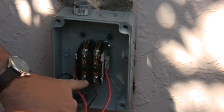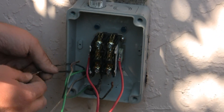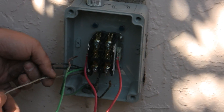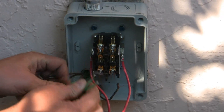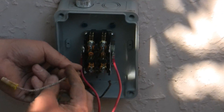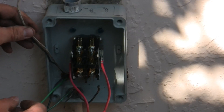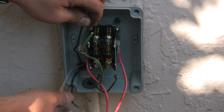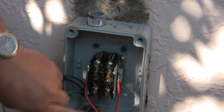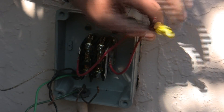Top is the in, bottom is the out. Pump was going off at 220. They had two legs of 110 and a neutral, which I believe was what was disconnected or not connected. And the ground — as we connect to the pump ground, we have our neutral circuit, and we'll take the neutral and one leg of the 110, run this to the controller to feed the controller, which is a 110 controller. Another section of this 110 wire will go to feed the pump, and then the two legs of the 110 going out to the pump will connect to the bottom of the relay. These two wires are 24 volt wires that go to the controller.